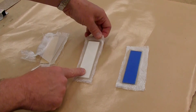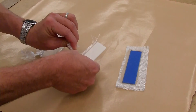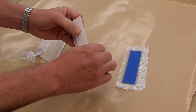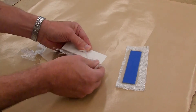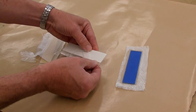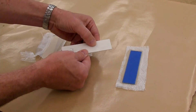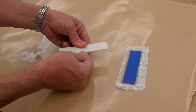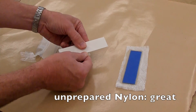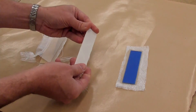Next, the part printed by Shapeways. This adheres really well — the fiberglass is tearing around the edges. The grain in the Shapeways printed plastic really works well for locking in the epoxy. It breaks before it comes off.